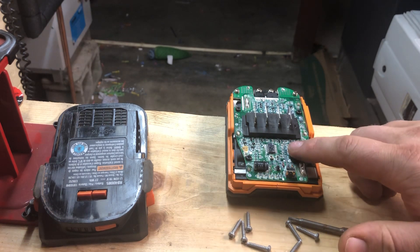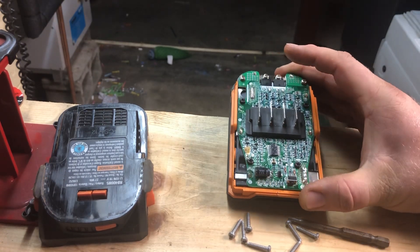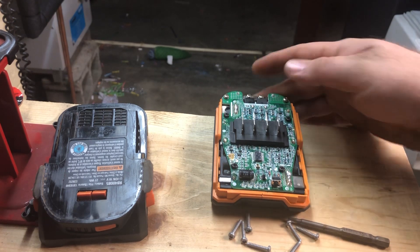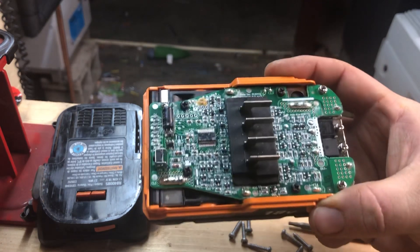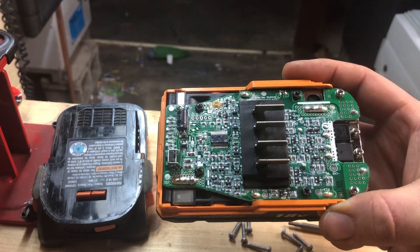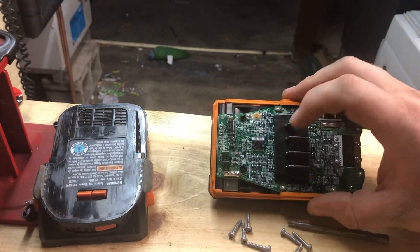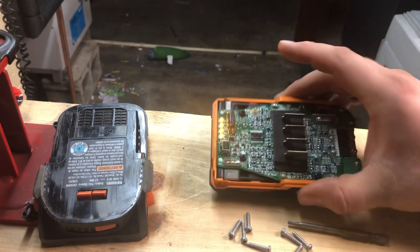The battery is now fully charged and ready to go. These batteries are kind of expensive, and I thought if mine was really dead that would stink — but there was more to them than I expected. The board is conformally coated, so when you go in and start cleaning you will remove some of that coating. When you're done, consider applying some lacquer, nail polish, or varnish to recover it. It's copper, so it won't rust, but that's what I did to resurrect this battery — it took a full charge and is ready to rock.